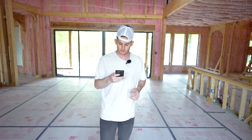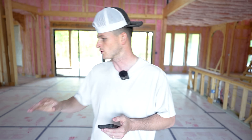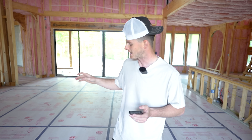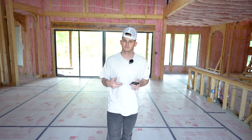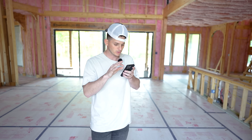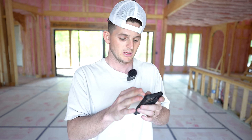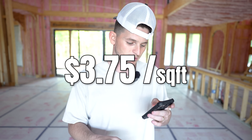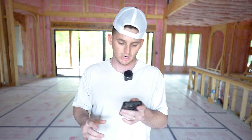Now for the cost of the polished concrete flooring. The invoice is broken down into two costs — the first being for the actual polished concrete floors. There were a total of 3,004 square feet on the bottom level of this house, at a rate of $3.75 per foot, which came out to a total of $11,265 for all of the polished concrete flooring process.